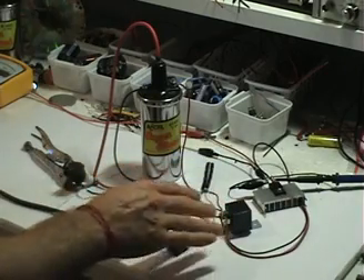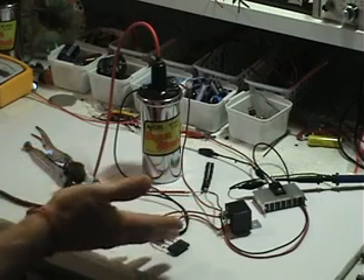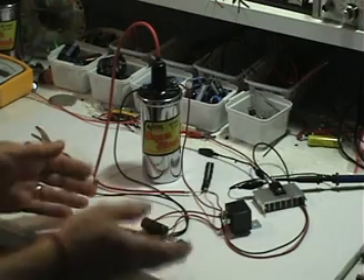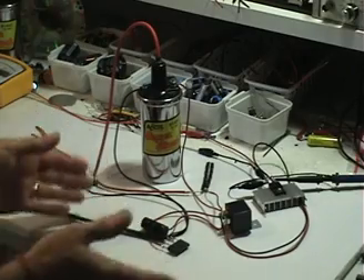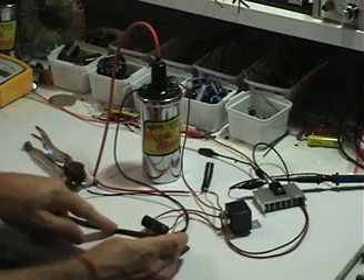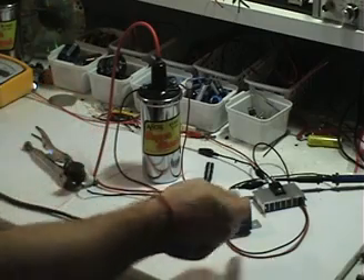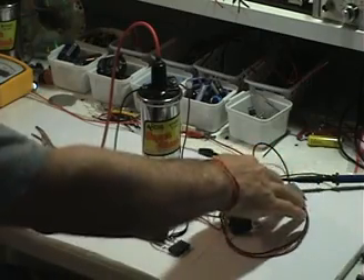Please go to the link to get the schematic on this most updated circuit and I will show that this circuit is capable of actually exploding water. Originally I was showing this circuit with an inverter that would take the 12 volts and change it to 120 AC, but I decided to forget about using an inverter. This bridge rectifier I'm going to plug right into the AC grid of the home — 120 volts AC, 60 hertz going into this bridge. The automotive relay is being triggered by 12 volts to click back and forth.